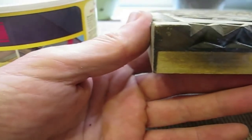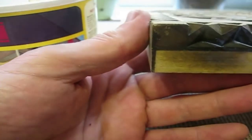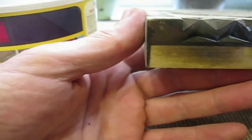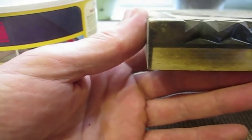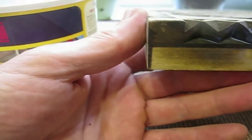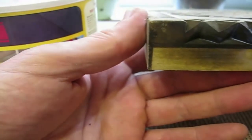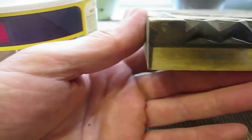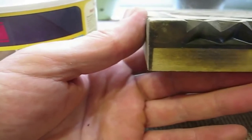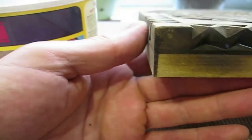Why use acrylic lacquer? Because it dries fast. You can always use different lacquers, but I prefer this one. It has no odor and it dries very fast and it looks good. Cover the whole board, wait an hour, and you can apply another coat, and you can use a third one, but two is enough.